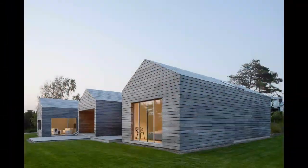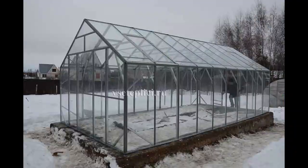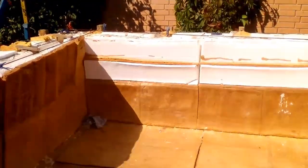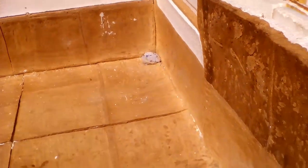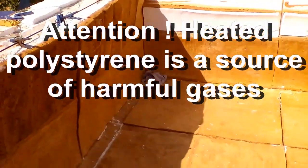These photos show objects with sizes and shapes similar to our storage with 100 cubic meters of water. Thermal insulation of the walls consists of sheets of expanded polystyrene, and they are not glued together because the pressure of the storage water reliably fixes them.